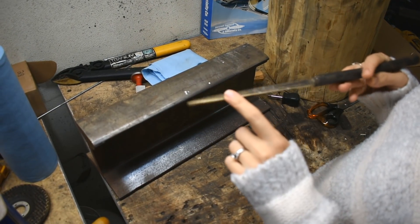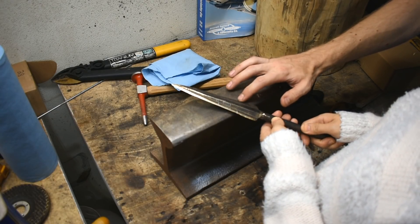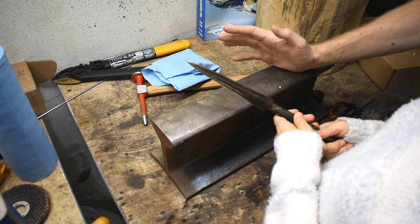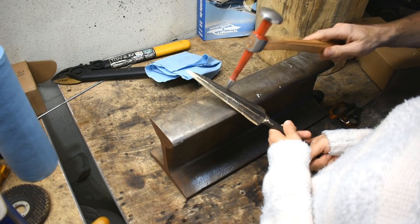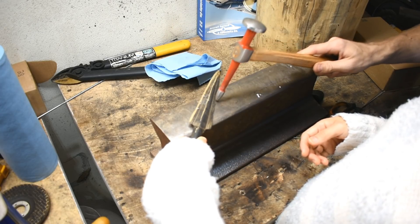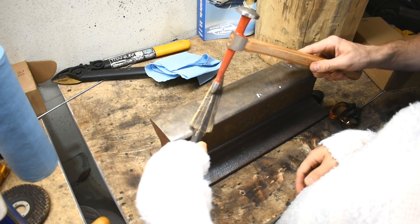No one tell her how much hammering and blood this makes. So this is not like steel — with steel you can quench it, heat treat it, and do some other stuff. There are some aluminum bronze alloys that you can do that, but I eyeballed the alloy on this pretty hardcore, so I have no idea how you would heat treat this properly. But all metals, especially aluminum bronze, will work harden. That means the more you bend or try to compress while it's cold, it will get a lot harder. So we're going to take this hammer and hit along the edge with the edge sitting on this railroad track — hardened steel hitting a hard railroad track. Where you hit, underneath that impact will be much harder than areas that have never been hit, giving us edge-holding sharpness and a crack-resistant center spine.